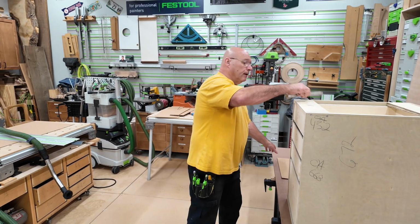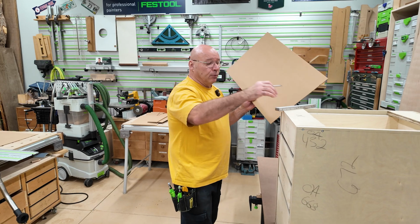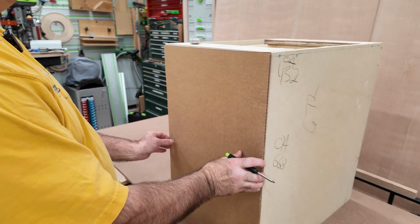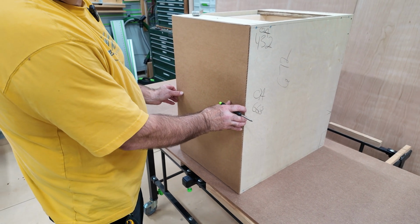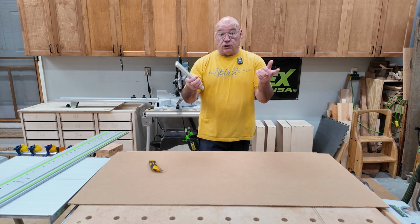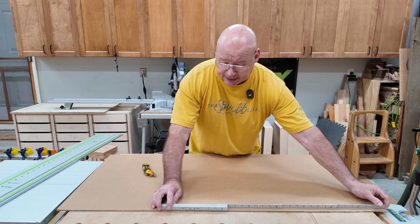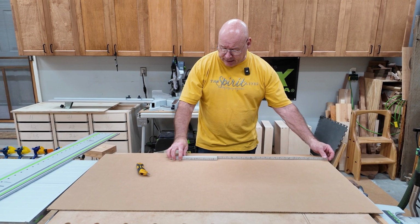Overalls, well, guess what we're gonna do? We're gonna cut a piece of cardboard, come in here, cameraman, that fits exactly in that 2mm range that we have for our mock-up of drawer fronts. So let's transfer those measurements, 668 and 432, onto the cardboard. Boom, here, and I always make two witness marks, okay?